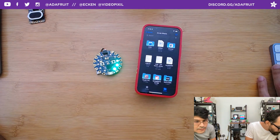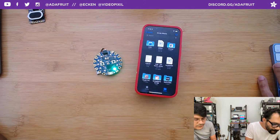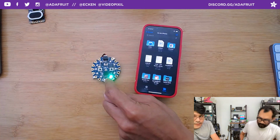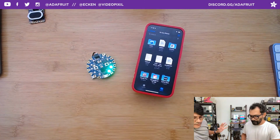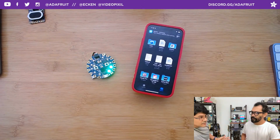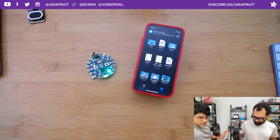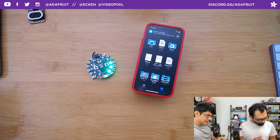A72 is asking about Bluefruit. So any of the Bluetooth boards we're hopefully going to start supporting. For starters, this is the Circuit Playground Bluefruit. That NRF52840 is the chipset that we really adore for all BLE project devices. Another one would be the Clue board. That one has the NRF52840. Hopefully that will get supported soon. It has a screen, temperature sensors all over it, touchpads as well, in that micro:bit format.